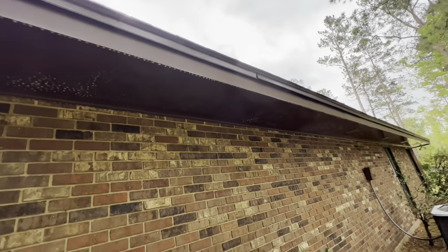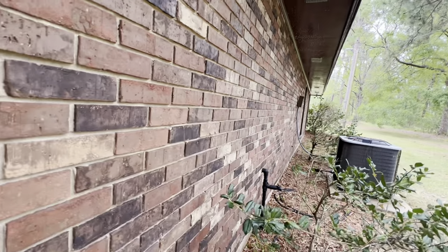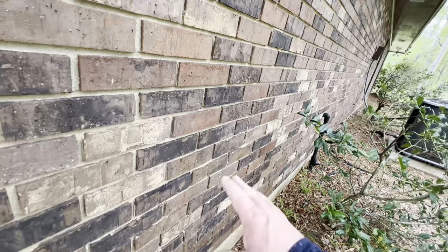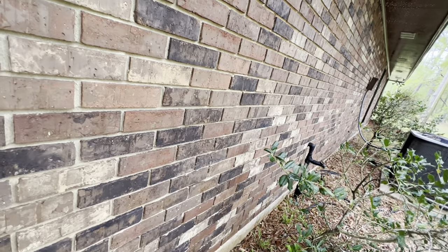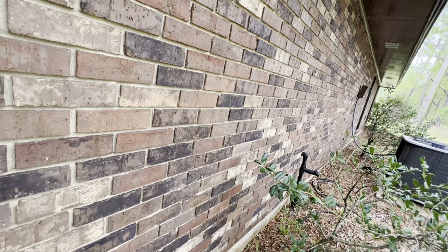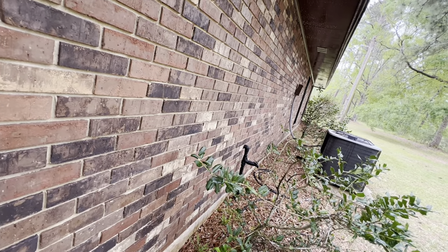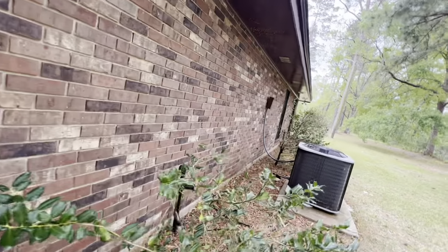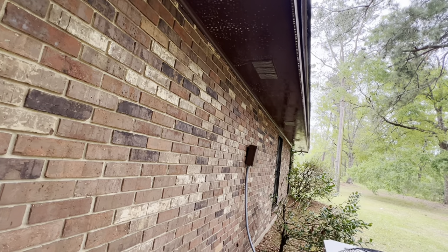We're keeping an eye on it and then we're going to come back and rinse. Now this brick — if you see brick with really severe mildew, the downstream injector is not going to take care of that. This one is not bad at all, but if you have brick that's really green along the bottom, or red clay stains, that's a different animal. If it's mold and mildew you can come back with a stronger solution using a 12-volt system dialing up with your proportional valves, or an X-Jet. But I've found a pump-up sprayer is great for hot spots — just hit those specific spots with a stronger solution.